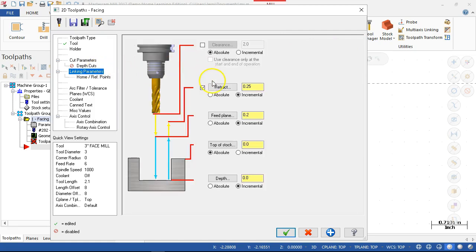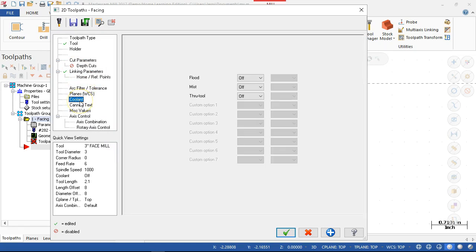No depths of cut. Linking parameters. We're probably only taking 10 thousandths at most. If we decide to use this on the backside though, and we have a 1/4 inch of engagement, a 1/4 inch of cut, that's going to be a pretty heavy cut. All right. So in that case, I want my retract to be a little bit higher, so we'll go back up to the 1 inch, and whatever the material is, I want that feed plane to be above the material. So if I have a calculated 1/4 inch, 300 thousandths, so it's not coming down plunging onto the material, the oversized stock. Top of stock 0, depth 0, and the other thing would be checking out for the coolant,